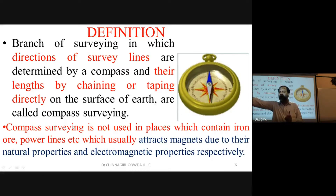In compass surveying, we lay the direction of the line using the compass, then measure the length with chain or tape. The compass measures only the horizontal angle — the orientation of the line with respect to north.